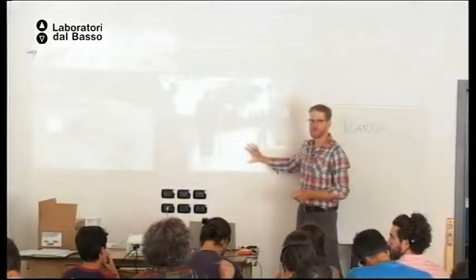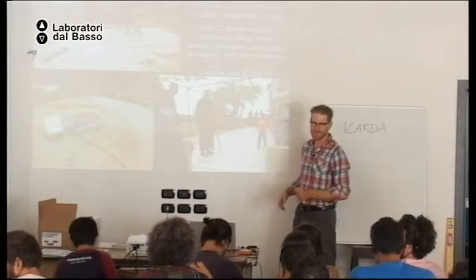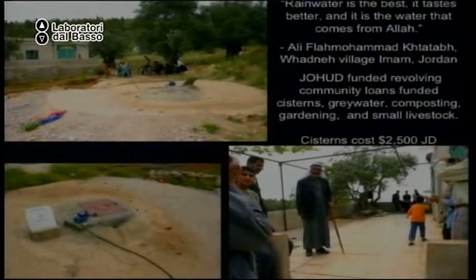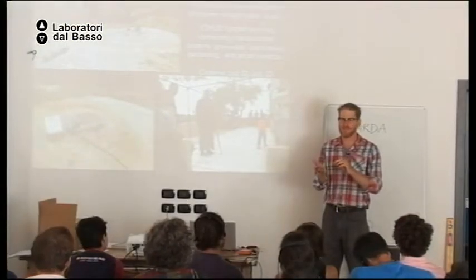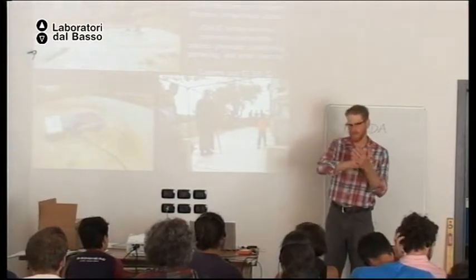So the new cisterns, they use Portland cement, modern cement. And they then seal it with what I call Portland slip. It's just the cement mixed with water, no sand, no rock. It's just the cement.